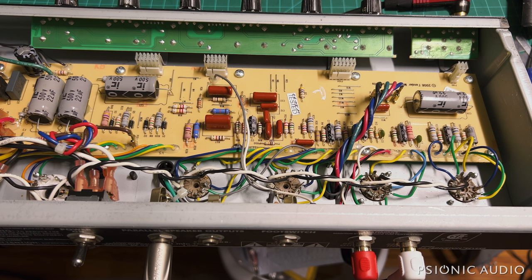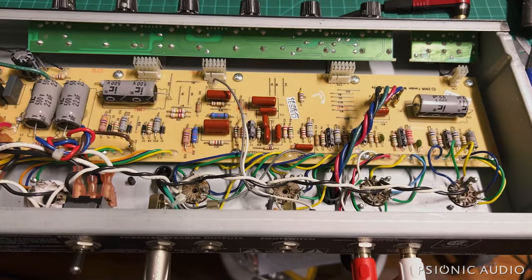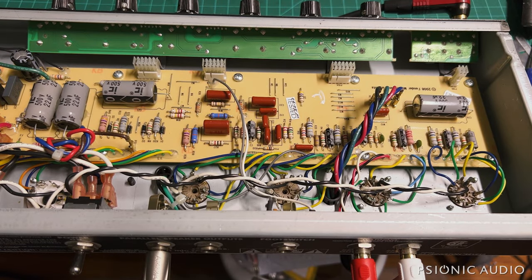You can also plug a guitar into the return, but you have to do a little impedance trick — it really needs a buffered pedal. You also got to see me diagnose the biggest issue of the amp, which was that big background noise — that was just a bad 12AX7. And for those new to this, you got to hear what a microphonic tube sounds like in V3. Let me tap on the output tubes — they're JJ's, which don't tend to hold up well in combos, but they may be fine. I'll talk to the owner about whether he wants all four new preamp tubes or just the two that definitely need it. I think he's going to be happy. I'm going to put this video up and let him see it, and then the two of us will speak.